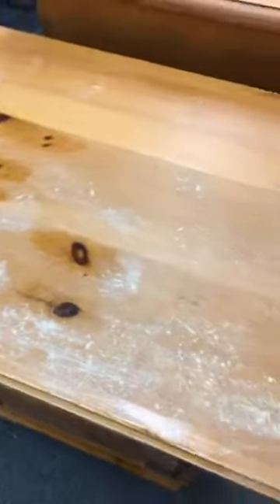So I've already started on them. I've given them a light sanding with 220 grit and the tops were pretty rough on them, but instead of trying to make everything completely smooth I've left some of the dings and stuff, but some of the bigger ones I filled in with wood filler. You can see here that there's wood filler in it, but if you look closely you can still see that there's still marks. I want to leave that. Pine is pretty soft — it marks very easily — so I'm not going to completely make it a hundred percent new looking.